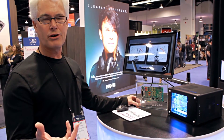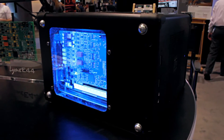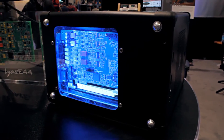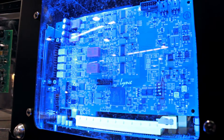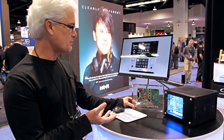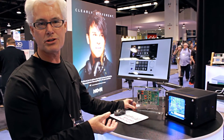The digital IOs can be selected to be in either AES/EBU or SPDIF mode. The performance of the analog section is actually slightly better than our Aurora product, so if you like the sound of Aurora, here's an option for you to get four channels of Aurora Plus analog performance. It comes with our SyncroLock low jitter sample clock generation circuitry as well.